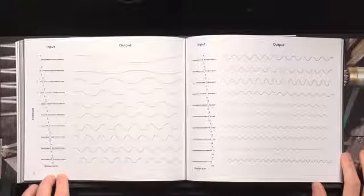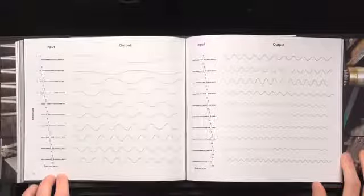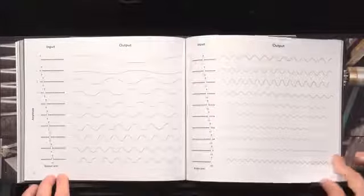If the pen is pushed too far onto the paper, there will be increased friction that resists the movement from the summing lever. This will result in a smaller apparent amplitude. Note the squashed section in cosine 19x. What happened here was the paper was not flat on the platen, but bulged out slightly. When the pen reached the bulge, there was a sharp increase in friction, and the pen could not move up and down as freely.